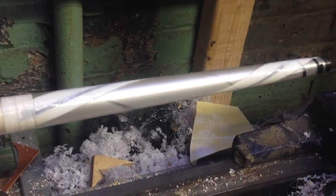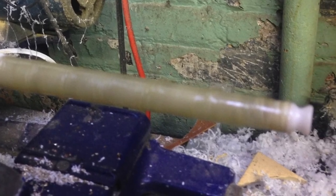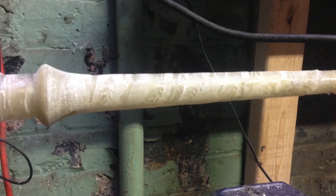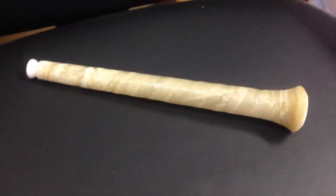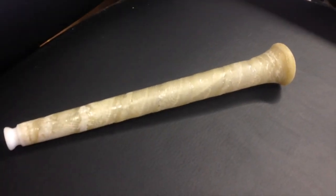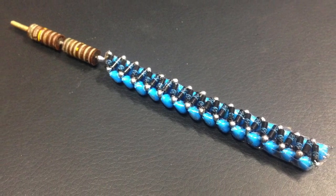To form the case of the wand, I took some thin plastic sheet and rolled it into a tapered tube. Then I coated the entire tube in strips of fiberglass. Once the fiberglass was cured, I did some final shaping and sanded it all down, but I left the spiral-wrapped look of the fiberglass exposed because I thought it looked pretty cool. Finally, the multiplier was reduced down to 15 stages, giving it a total of 120,000 volts output.